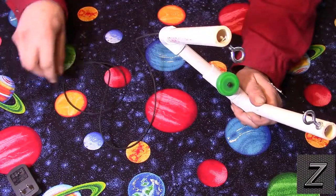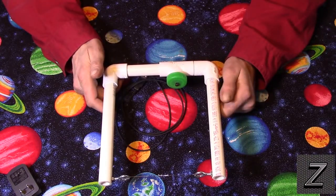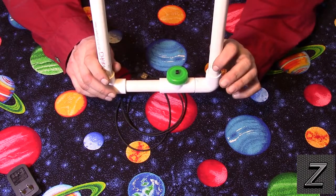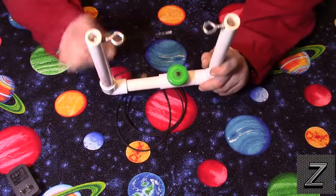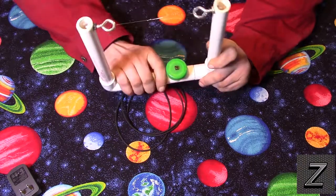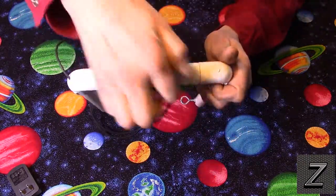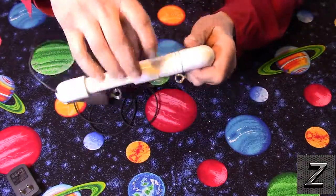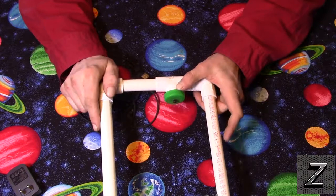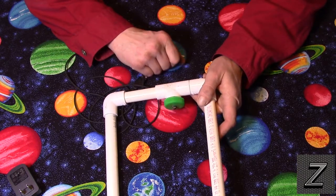That's all you need. All right, with that, I guess I really can't think of anything else to go over. This is pretty easy to build. I think it took me not even an hour to put this whole thing together, and that was taking my time. It is not very hard to do at all. You could substitute other things instead of the milk cap, but the nice thing about the milk cap is that inner rim in there fits over the 1/2-inch PVC perfectly, so it's centered. Then I just squirted some hot glue around it and held it on for a minute while it cooled. Good to go. And if I need to get in there for some reason to resolder something, if it comes loose, you can just take an X-Acto knife and remove the hot glue and get in there if need be.